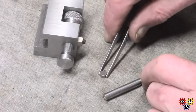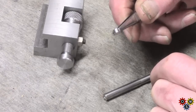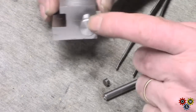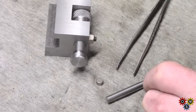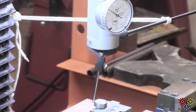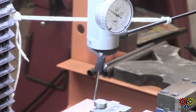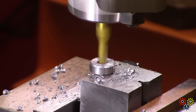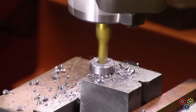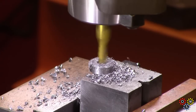It's a piece of quarter drill rod — we cut a tiny little slice off to make this little slug. The idea is that we're going to put that into the centre of the end boss. We were going to do a case harden, but I think this is a better method. Just centering up on the end boss here, because we're going to mill out the pocket for the drill rod slug. We'll take the pocket down just deep enough so that the slug can be loctited in and be just perhaps a thou proud of the surface.